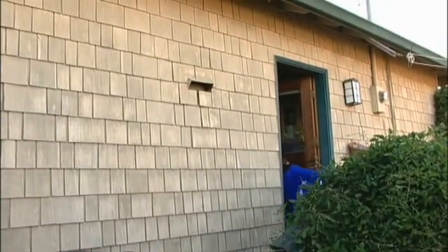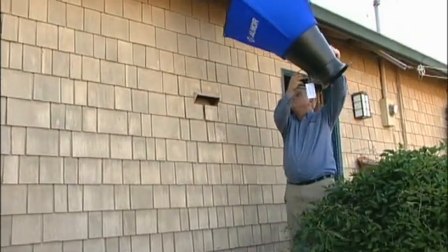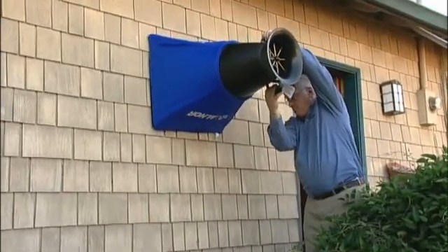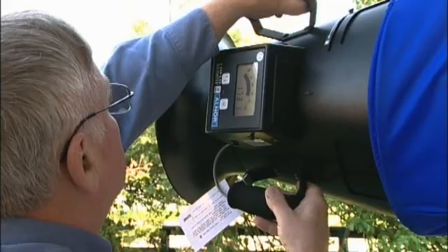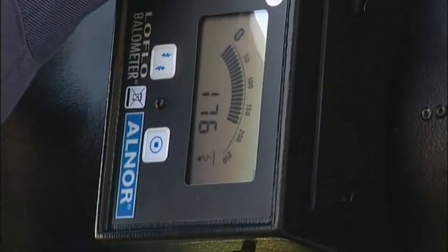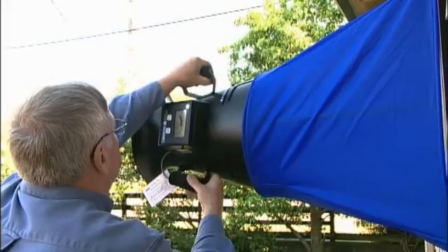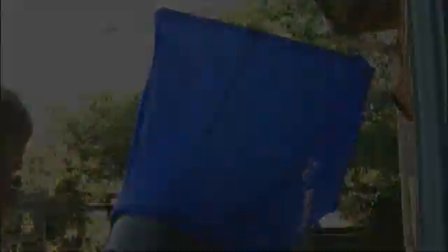This device can also be used for the discharge side. In this case it's a rain hood that discharges out through the sidewall. The device can go up against a rough surface with shingles and it'll compensate, with most of the air going through it — in this case about 175 CFM. Note that the control has been changed so we're now measuring the discharge of a fan. Again, use the lock button to hold the number and bring it down to read it comfortably.